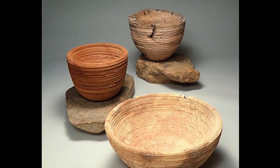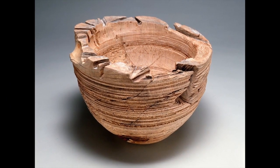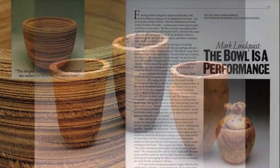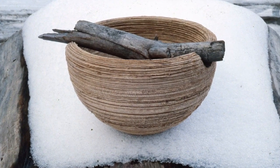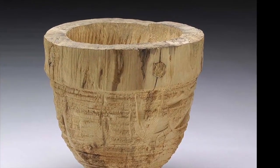Dale gave me that jacket there. And when I first began doing the textured pieces, which was about 1979, 1980, I was turning the wrong way on purpose, where I essentially went back to when I first began turning and used to catch the tool in the wood, and it would make just horrendous gouges. Well, then I started catching the tool in the wood on purpose and trying to control those catches and creating very interesting textures that revealed the grain of the wood.